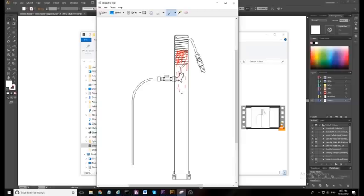It's almost like you'll get rain from this coil — it'll start dripping back down onto the packing. A lot of that spirit will enter this little cup or elbow, directed by some wire, and some of it will overflow back down onto the packing. So only a small percentage will exit the still and the majority will fall back down on the packing. That ratio of how much exits versus how much falls back down is known as the reflux ratio. At 100% reflux ratio nothing would actually come out of the still.